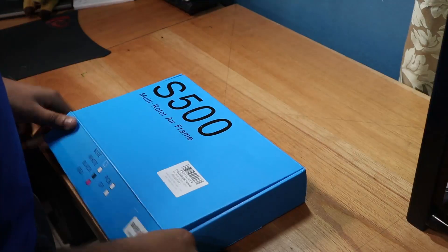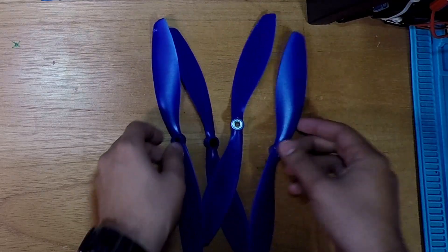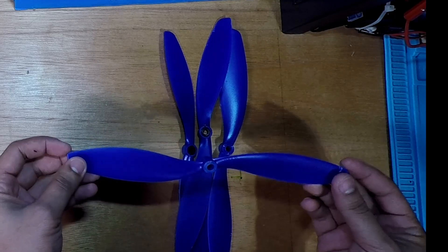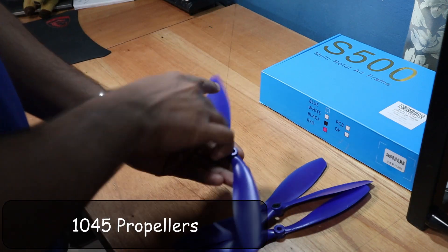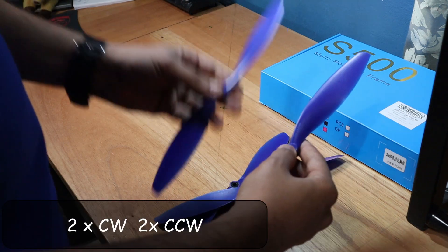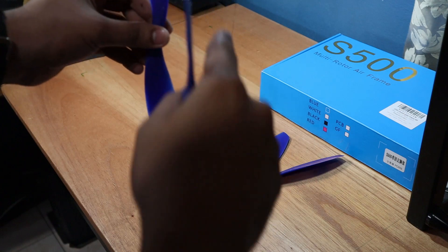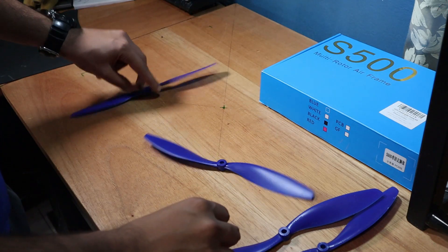After selecting your frame you need to pick a propeller that can provide enough lift. Choosing the right propeller is usually a trade-off between your motor power and frame size. This frame recommends blades between 10 to 12 inches with a pitch of 4.5 or 4.7. I had these 1045 plastic props from my previous drone build — that means 10 inches, 4.5 pitch. They come in a variety of colors, and you're going to need two clockwise and two anti-clockwise rotating blades. This is important for the drone to hover: a clockwise blade spins one way and an anti-clockwise blade rotates the opposite direction to send thrust the same way.